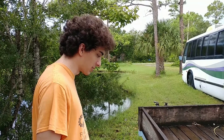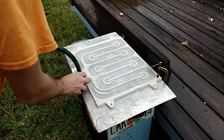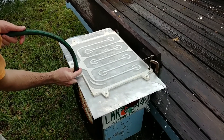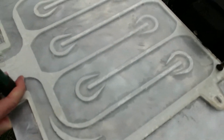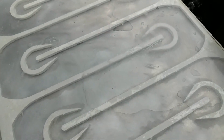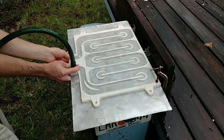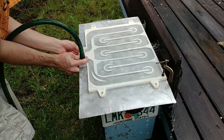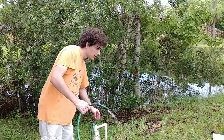Here we have the first prototype of the heat plate. I'm going to apply water to it just by pushing it into one of the openings here, so you can see with the bubbles the way it flows around. Now the problem is right there — you can see there's a pretty sizable leak that actually occurred after the first time I pressurized this, and then those little ones on that side have just always been there. Unfortunately that puts a lot of doubt into its ability to hold pressure.